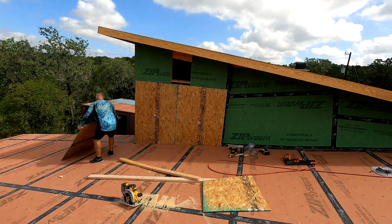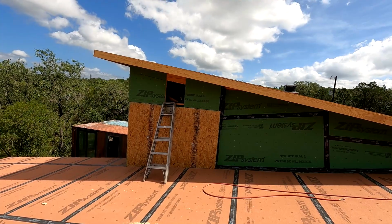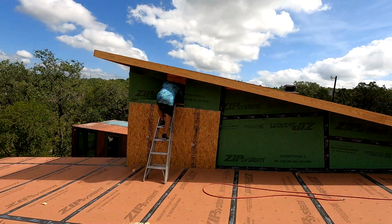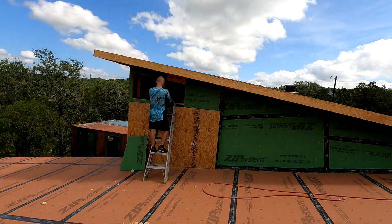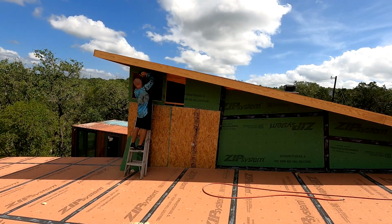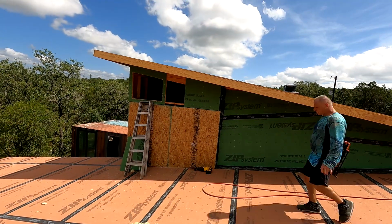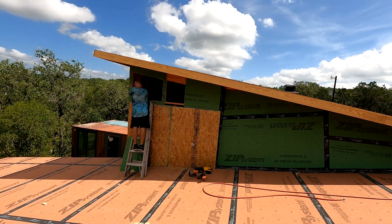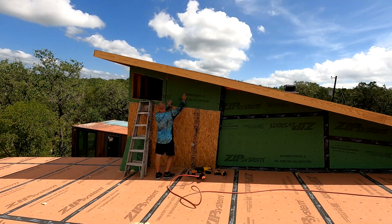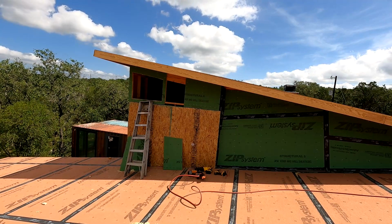The other thing was, you saw me thinking there, AC. The air handler is going up in the attic here on the very far side of the container. So I had to cut a bigger hole. You just saw that pop out. And it's 21 by 21 by, I believe, 4 feet tall. Something like 48 inches or 52 inches, one of the two. But it could lay down. The orientation could be laying down. And I need at least 21 inches to get it into the attic. So that's plenty right there.